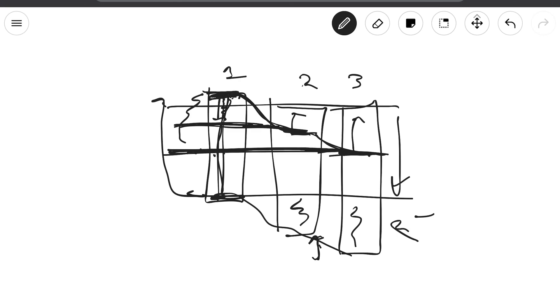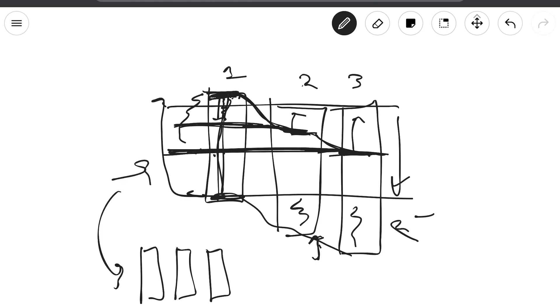I would really suggest: don't bother with a passive balancer in either situation. If you have three cells that all have exactly the same total capacity, best case scenario it's not doing anything. Maybe it'll help you do a little bit less maintenance on your cells, but you're spending money and it's not actually doing much for you. If you think you're in a great situation with perfect cells but it turns out they're not perfect, this passive balancer is just going to cause constant problems, give you really weird cell readings, and not actually do anything. It could hurt you and it certainly can't help you. It's burning power from your cells unnecessarily, which ages your cells — you only have a limited number of cycles. So if you're burning power just to balance things out without any benefit, you're actually aging your cells with nothing in return.